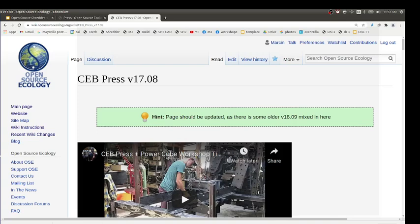Well, this is the same drawing as this, because this is where the liquid goes, but is this where we compress the material? Yeah, sorry, that is the cylinder, and that is the press plate, the press foot. Okay, so the press foot actually attaches to this thing. Right, so the press foot is actually here. We cut that. We get a truncated cylinder. We start with that off the shelf, then drill a hole through it, put a big collar on it, and put your press foot made of 1-inch steel on it, like that. These are big plates, 1-inch plates.